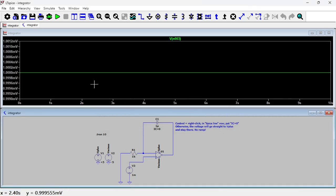What does an integrator do? It basically integrates, as the name implies — you don't need to do math at all. It's computing the area under the curve. So if you're here, it's looking at this area; further along it's looking at more area under the curve — in this case a straight line. That's why you end up with a ramp: as time goes by you accumulate more area. That's all integration means.